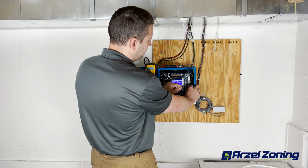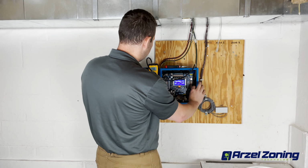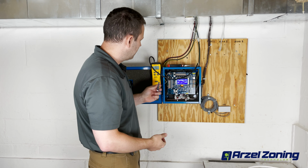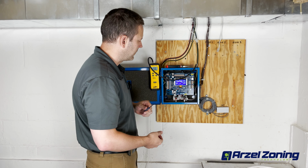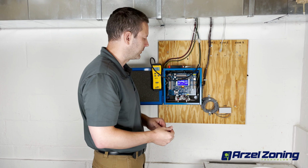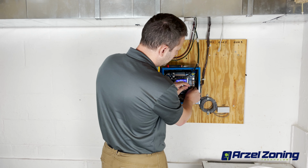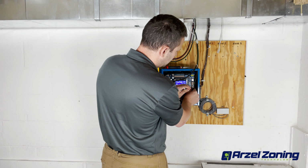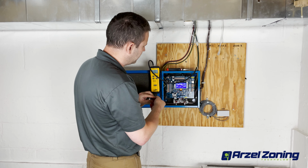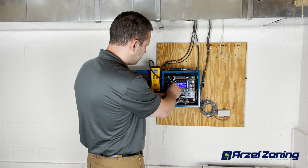And then we're going to disconnect it over at zone 3, so we can test zone 3. We can see that with zone 3 disconnected, we're getting over that 50 inches of water column right away. Zone 3 was a smaller zone, not a lot of dampers on it, so that one built up pretty quickly. So we'll go ahead and reconnect our wire there. So now zone 3 is calling again. Everything's back under vacuum. Now we're going to disconnect our fan call at zone 1.